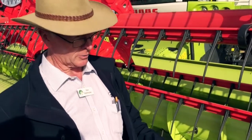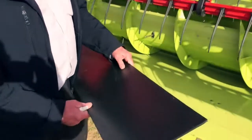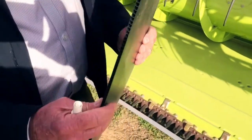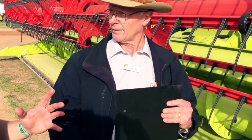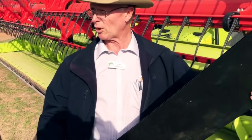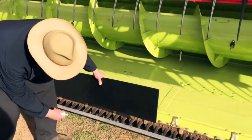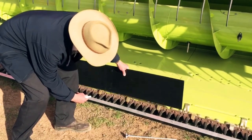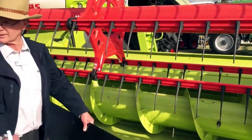So what we've found in the past that worked well — and it's not my idea, it came from some farmers in the eastern states advertised by GRDC's Ground Cover — we're all about sharing information. I just copied that idea and went to a sign writer and found some black corflute, which is like a black cardboard, five mil thick. You cut these sheets to be as efficient as possible. The sheet comes generally 1.2 wide and 2.44 long. I just got it cut into nine pieces for a 36-foot front. The main thing is to get a piece that's long enough to just come down and sweep over the knife section, sweeping anything away from there — one piece per turn of the reel, so as it comes around one sweeps it in.